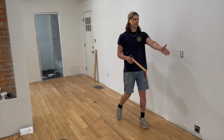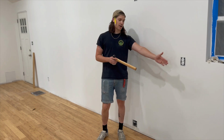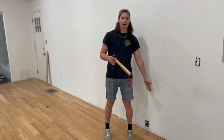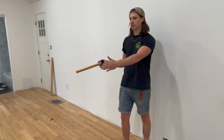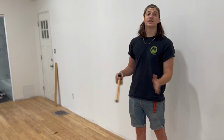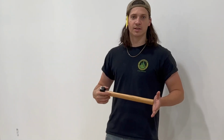So your first row is going to be maybe scooched back a half inch, which means you might have to cut half your boards back. Your starting row about a half inch more narrow, and then your finishing row will be about a half inch more narrow, instead of just your finish row being out by a significant degree. You're just going to want to try and split that difference.